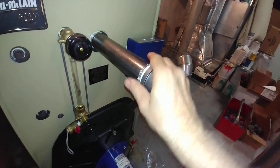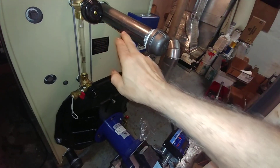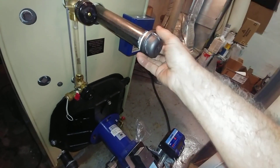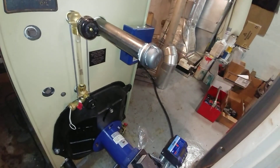This is the skim tapping — normally it comes plugged. The nice thing about having this long tube is it's slightly canted, so any dirt shows up here and collects in here over the use of this boiler. This cap can be removed and the goop scooped out.